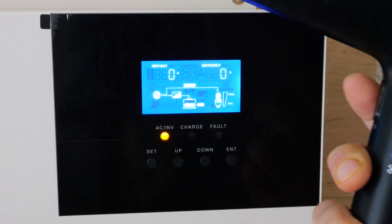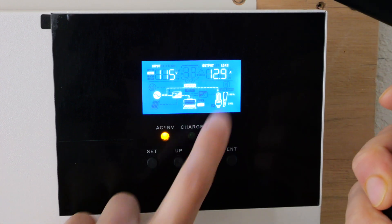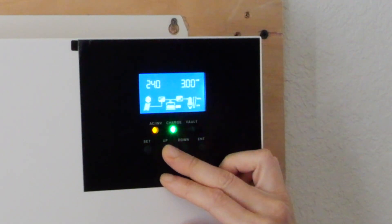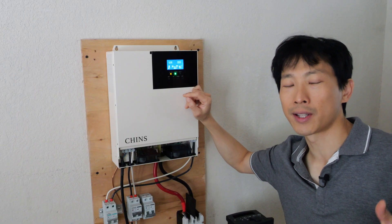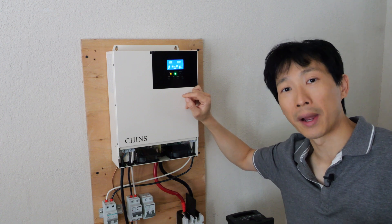If I turn it on, it's pulling energy straight from the AC — right there. The last few pages show 160, 24 volts, 3-kilowatt inverter, firmware version 5.28 / 0.00. This is actually the second inverter I'm trying, and on both of them the AC would not charge my battery.